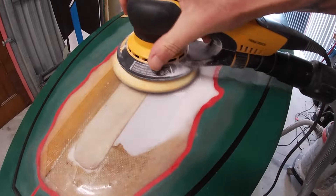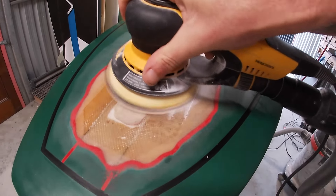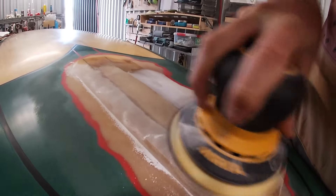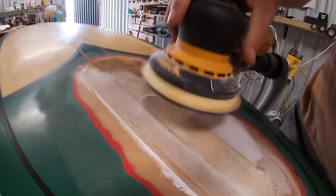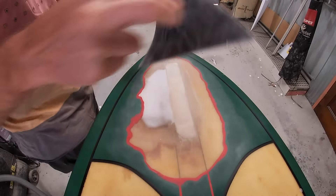With the hot coat cured, we're able to sand it all down, get it to a nice shape, and get rid of our masking tape edges. The hot coat doesn't cover the paint, so everything is adhered to fiberglass — and that is our repair done.